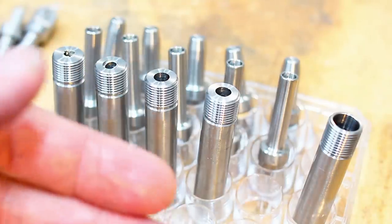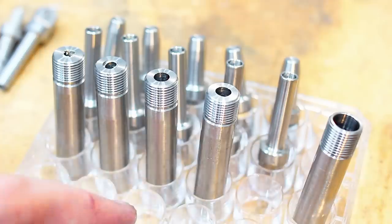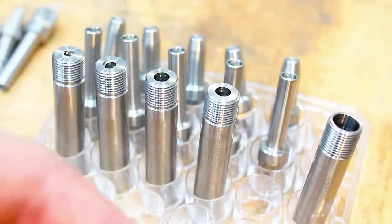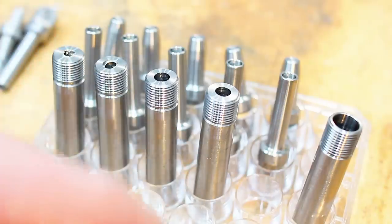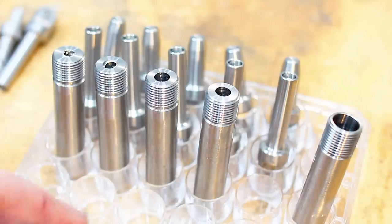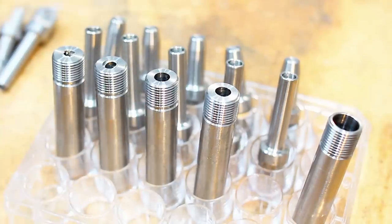I'm a little bit weird when it comes to spares. Once I run into the issue that I run out of spares, if it's not too much work, I will make another spare. For example, when I'm doing the boring now and I scrap one, I still have the one spare. A little bit weird, but sometimes that's quicker than wasting your one spare very early and then noticing very much to the end that you made a mistake and you need to do all the setups again, maybe you already have broken down tooling. That's the most annoying thing. And yeah, then it's just a world of hurt. So I try to keep my number of parts plus the spare constant. The spare is really for emergencies.